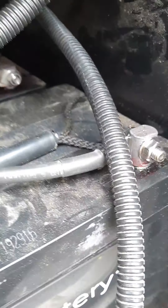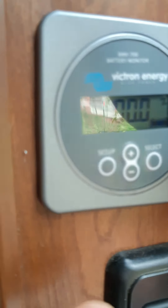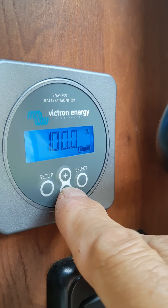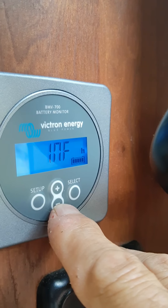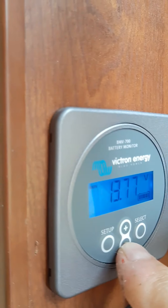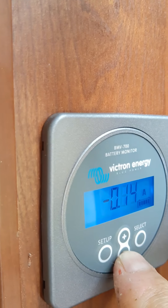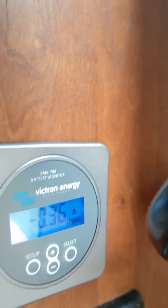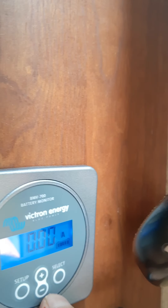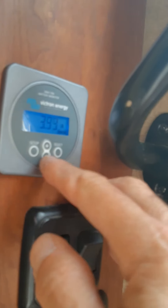Now when I look at my battery monitor, batteries are at a hundred percent and can run for infinity at the current load with the current power input from the solar. The batteries are at 13.8 volts and there's a current discharge of 0.3 amps or 0.1 amps — it's constantly fluctuating based on the cloudiness or sunniness of the sky.